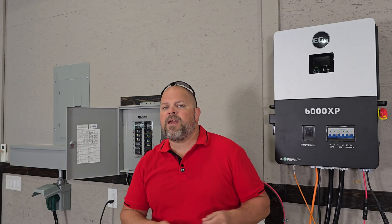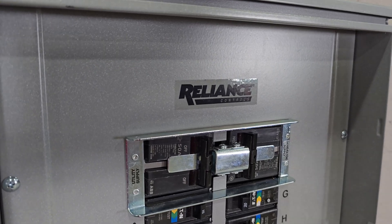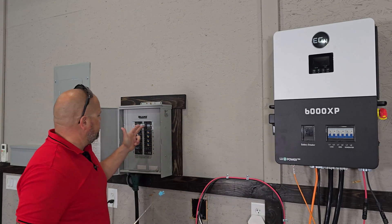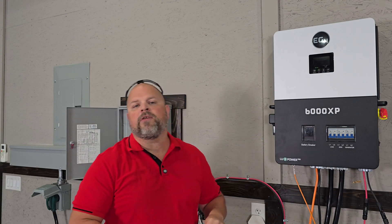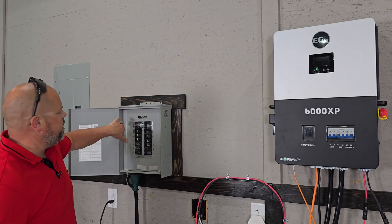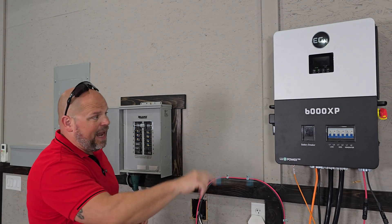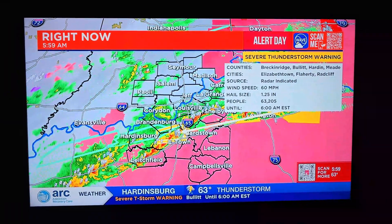Although this is an off-grid inverter, it doesn't mean you can't have access to the grid. My recommendation would be to install one of these Reliance Control 50-amp transfer switches so you can have access to both the grid and your solar power. When this is turned on, you're powering everything with solar. But if the battery goes dead or the sun's not out for two weeks and you can't charge your batteries and don't have a grid connection, you won't have any power. With a transfer switch, you can switch it and have power. I love the flexibility of having both the grid and solar power so I always know I'll have power in case a disaster knocks out my solar system.